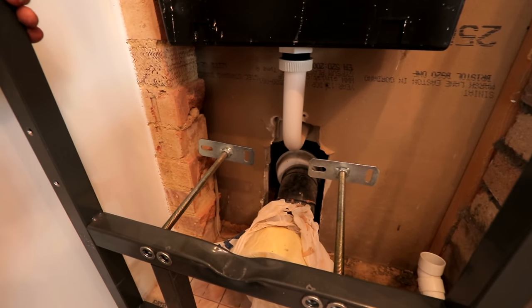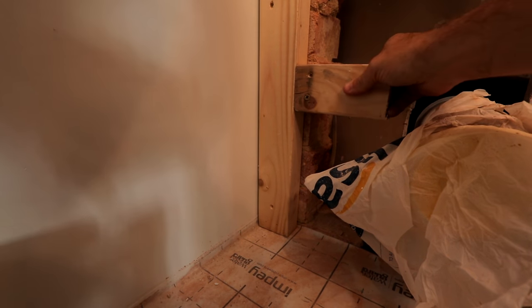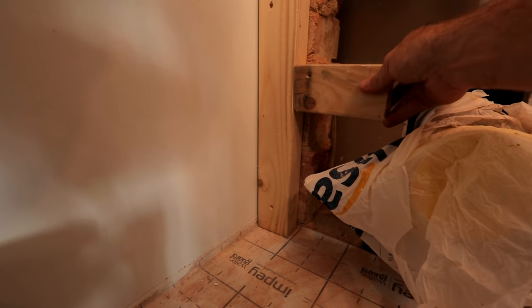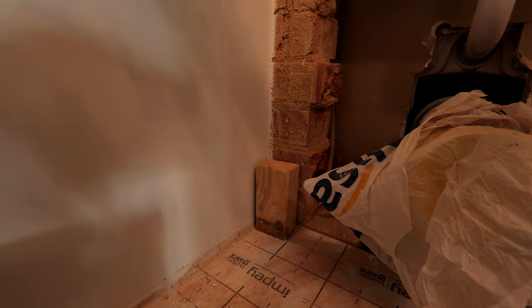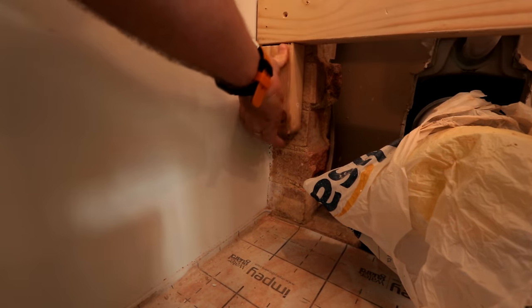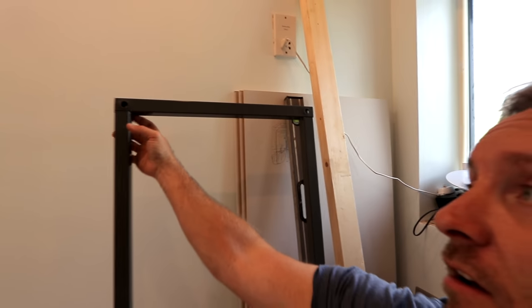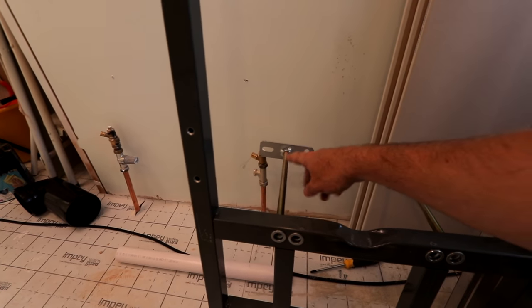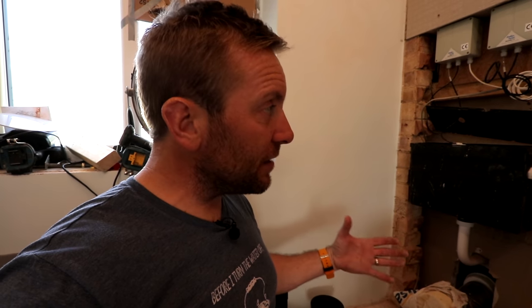There's obviously two ways I could do this. I could put a piece of wood up here, and then butt a piece of wood up against that - that could be the bit of wood that goes across here that takes that weight - but that doesn't feel right to me. I think the best way of doing it is to have a small piece of wood at the bottom here, come up to that, then carry on over, and then batten a piece of wood over the top of that as well. The first bit we'll do then is get our main frame up that goes around on the brickwork here, then we'll get our little bar across there, and then we'll get our bar across the top as well, because we've got another fixing point at the top. These bits here have got to be fixed back, and then our next place for fixing will be on the floor. By which time it'll be so well installed it would just be really, really good. It just takes time, guys.